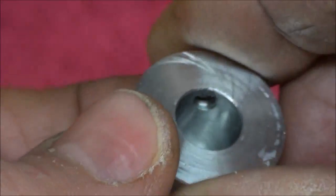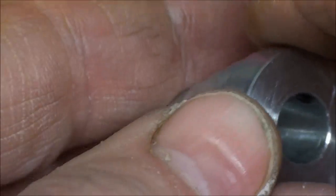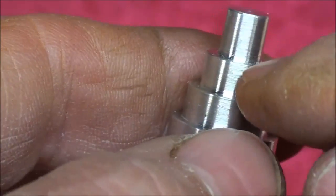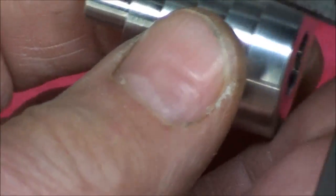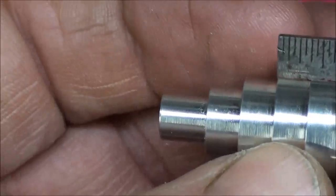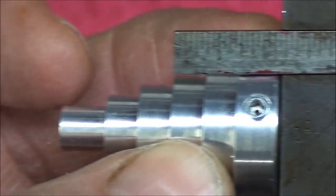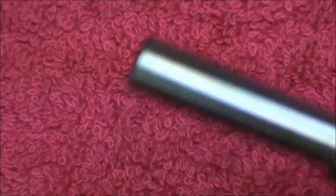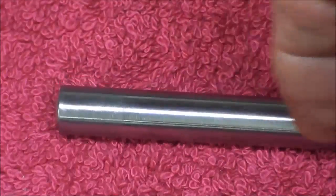I'm going to start by reaming this hole five-eighths of an inch deep. The hole has to be a blind hole — it cannot go all the way through, because at some point the hole will exceed the size of the end pieces and they would break off. So the hole is approximately that deep. It could go a little bit deeper, but certainly not into the last two steps. It's three-eighths because the shanks are three-eighths. You could make it half-inch if you've got a half-inch wiggler or edge finder, but these are only five or six dollars.